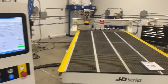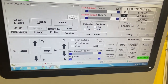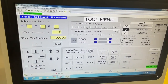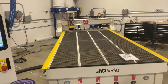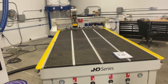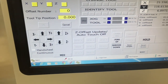That was a very smooth and clean tool change pickup. We're going to jog the machine away from the tool changer, go back to the main screen, increase our cut speed to 100 percent, and then do another tool change - let's change to tool number three. You can see we're moving a little quicker now at 100 percent. Again, really quick and really clean tool changes. Once you have an automatic tool changer, you never go back.